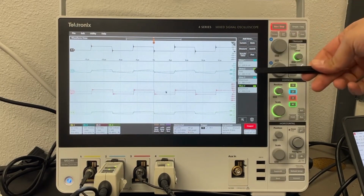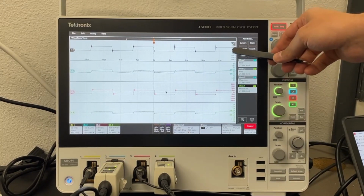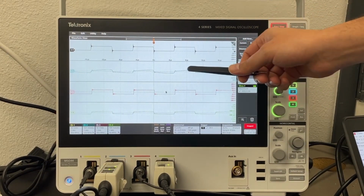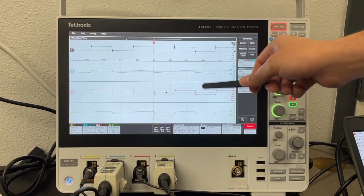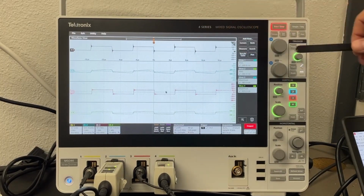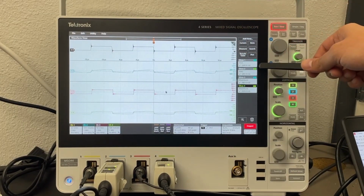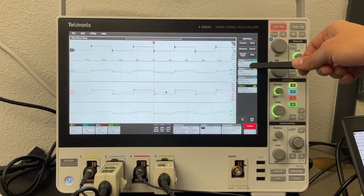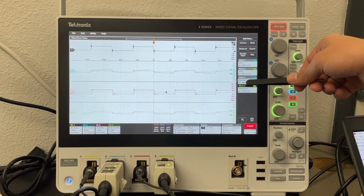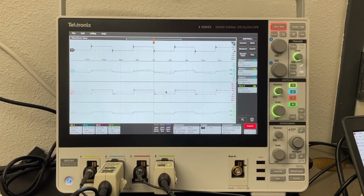Okay, as you can see here, it's again for 100 volts to 50 volts conversion. And now if you compare the current waveforms with the previous case, you can see that now we have a more flat profile, while the RMS current is 288 milliamperes, and with the maximum of 380 milliamperes, which is much less than the previous case with the conventional modulation.